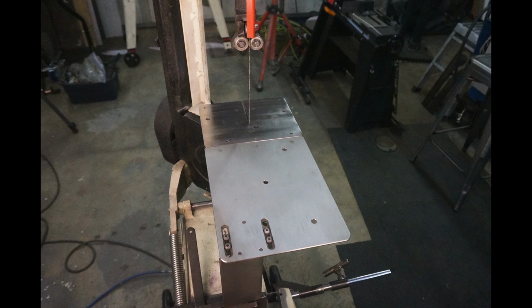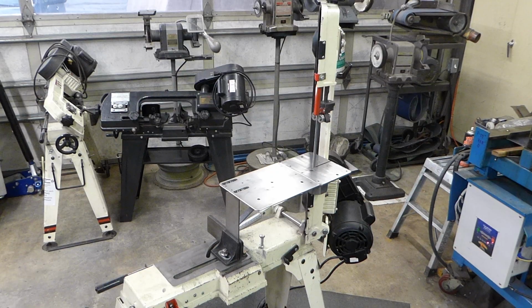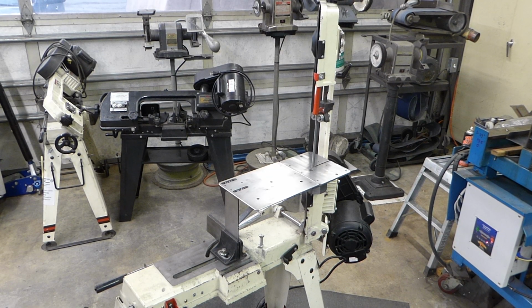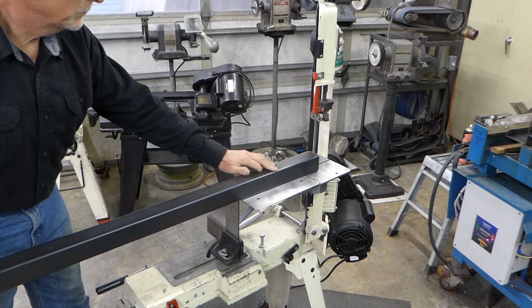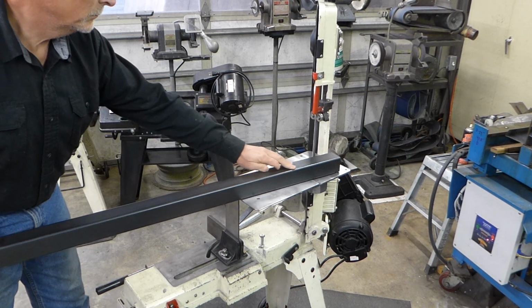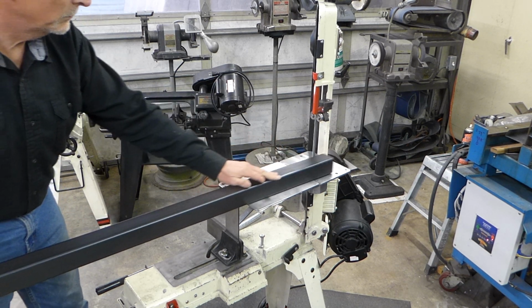It also employs a front leg that clamps into the saw's vise. This allows heavier materials to be handled without increasing the torque on the blade guide mechanism. While common sense must prevail, this allows the saw to cut much more substantial stock without biasing the blade excessively.